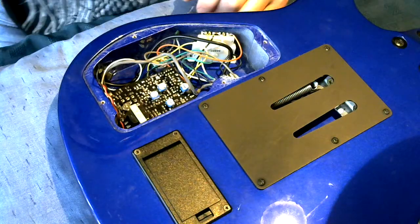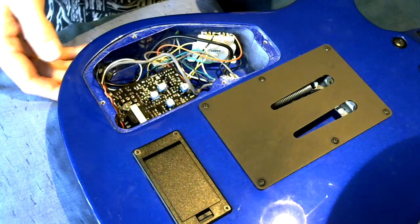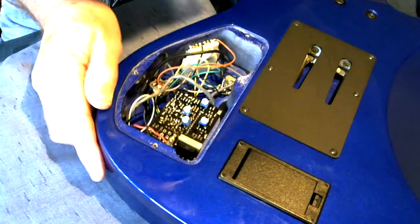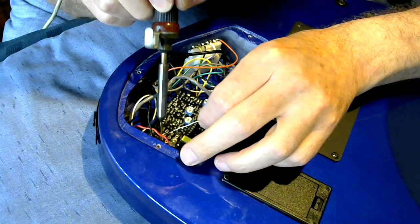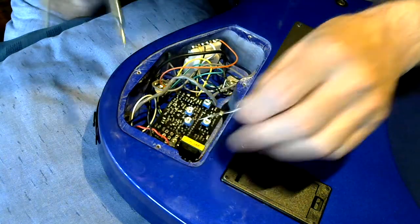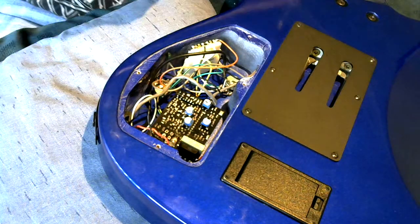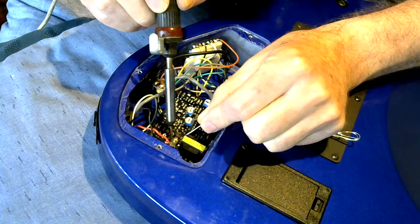So if I now solder those legs in, I know that it will actually line up each time you bolt it and unbolt it, because that's it held in tight, and that's the circuit board on tight. So this should now allow me to solder it in and line it up. So if I solder a couple of corners in, if I'm struggling to reach, I can then unbolt it again and know that it's held in place. Actually, I can probably get at all of that, so I'll keep going.